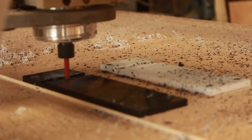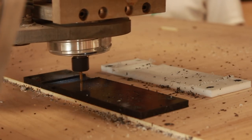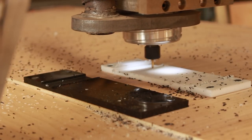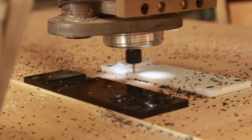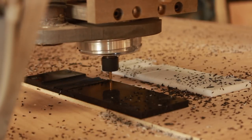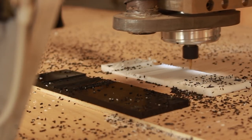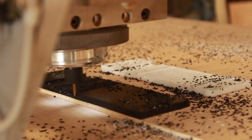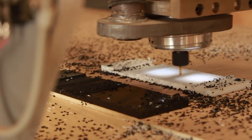It was at this point that I decided I've had way too much time into this thing. So I went ahead and set up the CNC router, took a V-carving bit and ground it to 71 degrees — which was the angle of the teeth — and I just manually went ahead and cut the grooves for the teeth in it. That actually turned out really well. I did it in both Delrin and Teflon just because I had pieces of both handy, and the Teflon one didn't turn out so great but the Delrin one did.